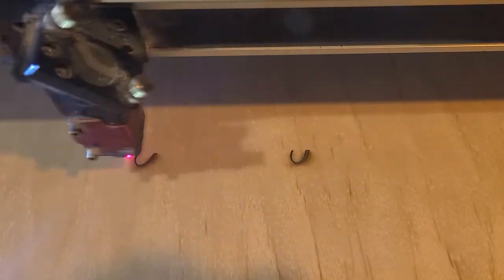You can see it going. It can actually go a lot faster, but you can already see it kind of coming in — that really dark engrave. That comes from having a higher power and a lower speed. I like it going at about 450 speed and 90 power to get that darker engrave. If I wanted it a little bit darker, I could go to 300 speed or 95 power, but this is actually the perfect balance for me personally.